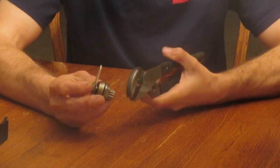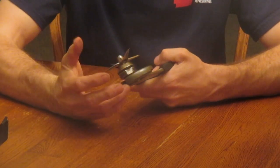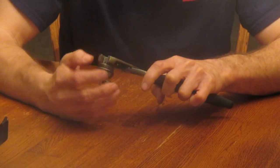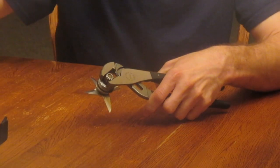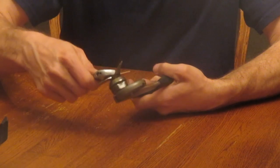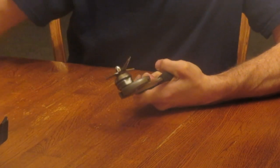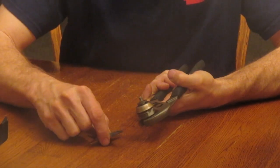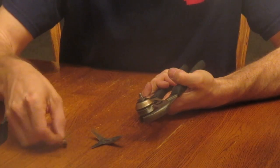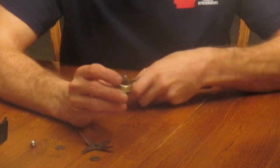I'm going to do a small demonstration of where it's at. Take a pair of channel locks — mine have pretty deep teeth, a fairly decent set. When you go down inside there, it does not impact the teeth; the channel locks line up inside there and will not impact the teeth on the actual unit. Then with a small adjustable wrench, you're going to spin this nut off. When you spin this nut off, you're going to find a round washer with a square hole, then your blade, and then another small square washer.